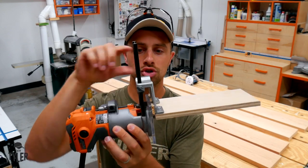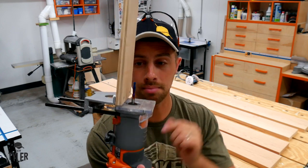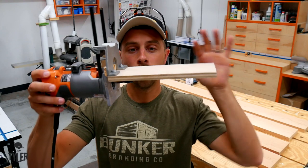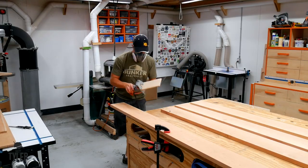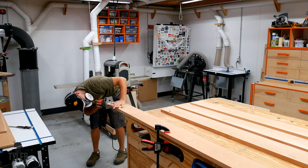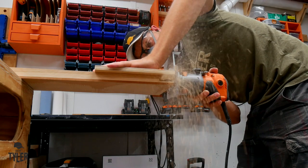What we're going to do here is use a trim router with the fence that comes with this unit and an auxiliary fence, and then I'm going to use a quarter-inch Amana bit to make our quarter-inch dados. The depth varies depending on the piece. We take this right to our board, slide it back and forth many times to make the dado cut — it is going to be a super messy job. While this step left an absolute disaster in the shop, I was very pleased with the results from this quick jig I had whipped up.